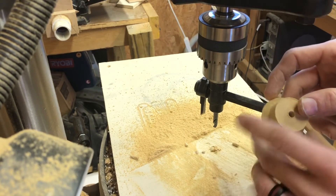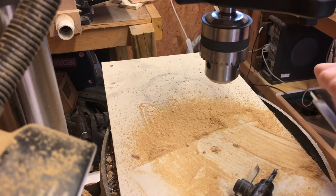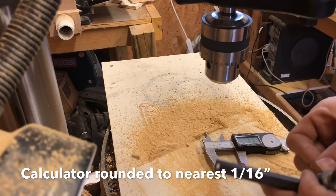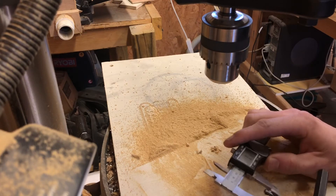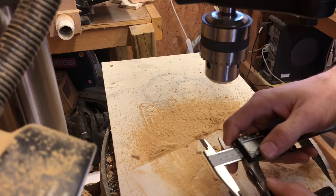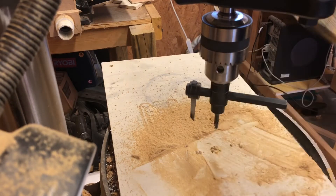This hole right here has got to be drilled out to 5/16ths to go on the end of the motor. Now to get the other pulley — the other pulley needs to be 2 and 3/16ths, so half of that is an inch and an eighth. I've got an inch and an eighth on my setup here and I'm going to move the bit out to that setting. You don't have to be exact as long as it's close — it's not rocket science. We're close enough. By the way, the bit's called a circle cutter.